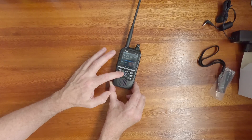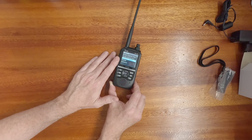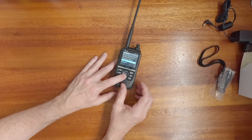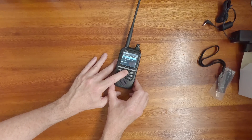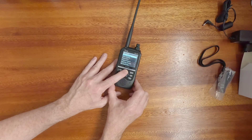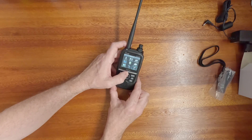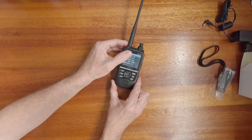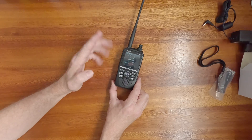Then I can put it into a computer and use the CS software — I forget the name — and that will allow me to program it on the PC. This radio also has Bluetooth, so I can Bluetooth in with my mobile phone or an Android tablet. I also want to find out the current firmware — I'd suspect it's older. Going to Set > Others > Information > Version: it's 1.22. I'm pretty sure the latest is 1.24 or 1.25, so this firmware needs updating. That'll be the first thing I do.